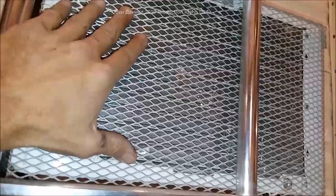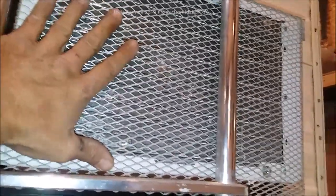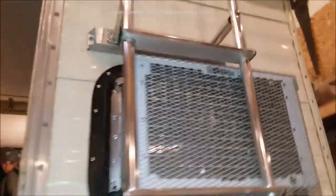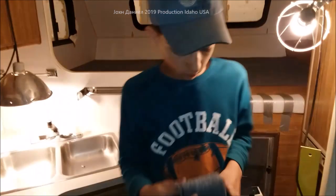There's one of those lights there, and this nice feature on the air conditioner — you see that? You can buy this. This is aluminum, and I want to use aluminum instead of steel because it will allow that to cool. Don't use steel expanded metal on your air conditioners — it'll cause the heat to concentrate and it won't be able to expel the heat out. Use aluminum so that it heat-sinks out.